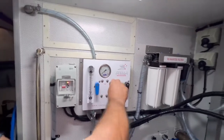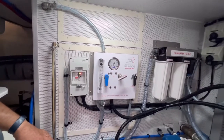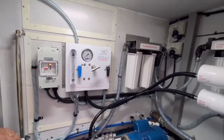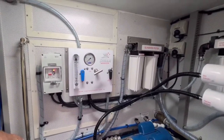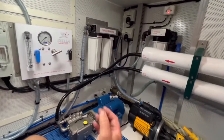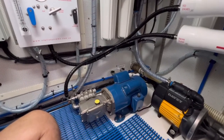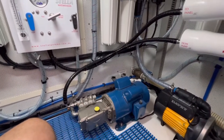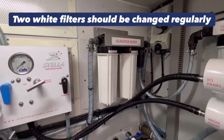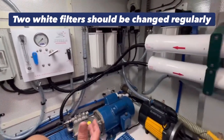It's worth mentioning to customers: be familiar with the sounds of these pumps. They will hold a fairly uniform tone, but obviously when starving for water or in dirty water the tone changes. You'll get used to the noise of the pump — when it starts to make a more high-pitched tone, it's starting to struggle for water flow, which means the filters are blocking. At that point you would change the filters. You'll recognise that over a period of anywhere from 20 to 200 hours of use, depending on the water you're making.